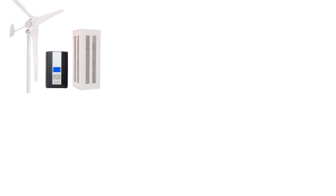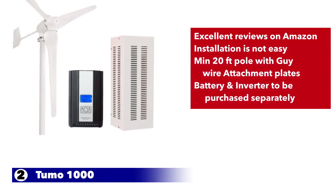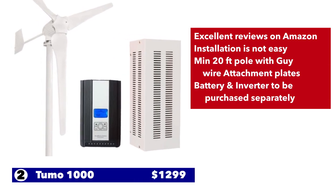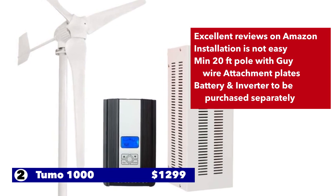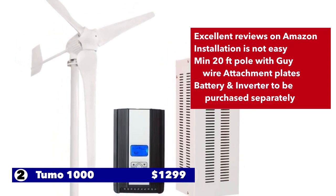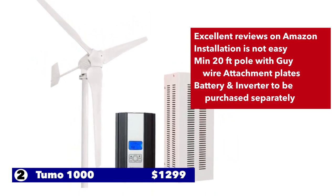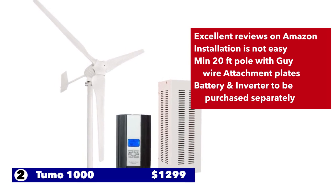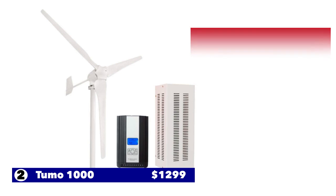At number 2, we have the 1,000 watt wind turbine. It has excellent reviews on Amazon. It's pricey at $1,299, but it is good value. Installation is not easy, as at 1,000 watts, this generates significantly more power than the earlier wind turbines we looked at, and it requires a more stable installation. A minimum 20-foot pole is required, and again, it's advisable to secure your pole with guy wire attachment plates.